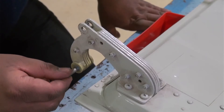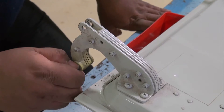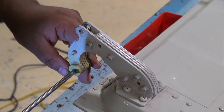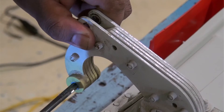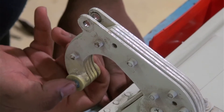The stainless steel sleeve supplied with the kit should be a sliding fit into the bush. In this case the sleeve fit was a little too tight, so we're opening it up with a 0.251 reamer. In most cases this should not be necessary. Now the fit of the sleeve is perfect.